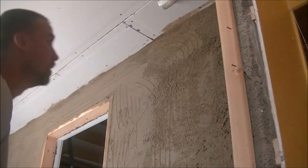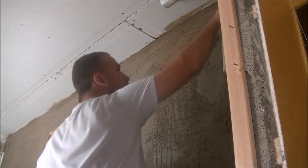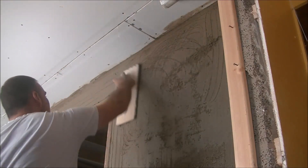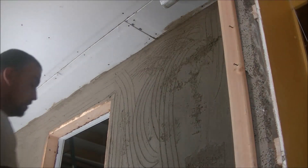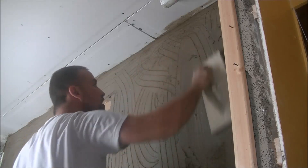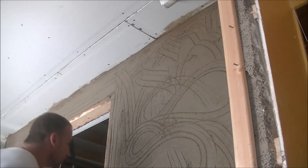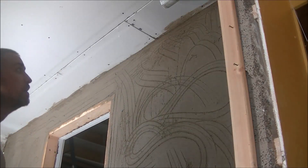It's quite important that you don't leave any big jaggy edges when you cut things back. At this stage you want everything as clean and tidy as possible — this is what your skim coat is going onto. You could just tile over the face of this wall if it were a bathroom — no need to skim; tile adhesive should grip to this key brilliantly. I've heard many tilers actually prefer this to skim-coated walls, so something to take into consideration. Getting a nice key — those marks will be lovely to help grip your sand cement and give a mechanical key to your skim coat.